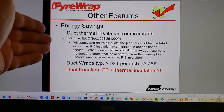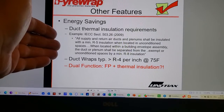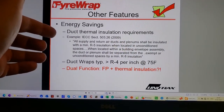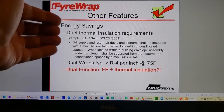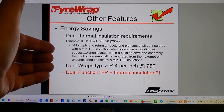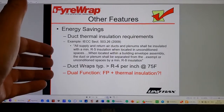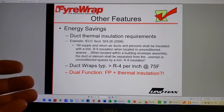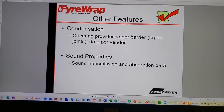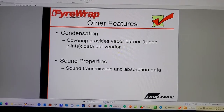Look, for pressurization ductwork, it's irrelevant, right? It's only there to pressurize for smoke control. For return air, you could see wanting to insulate that. But again, there's no requirement for fireproofing it. So if you wanted to insulate that to save on energy during normal operation, not in a fire, there's nothing wrong with that. You don't need to go to the point of fireproofing it. You use any normal duct insulation for that.